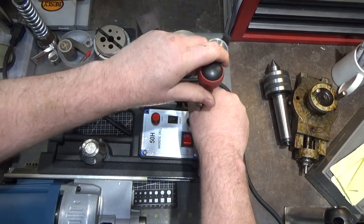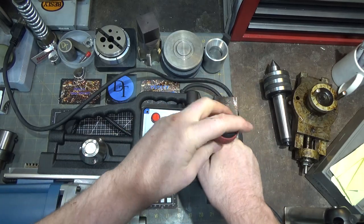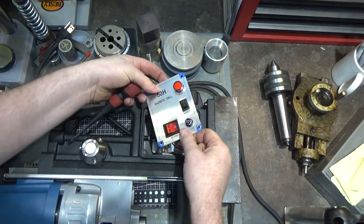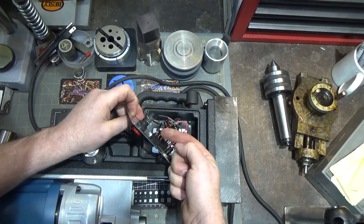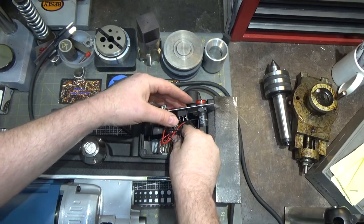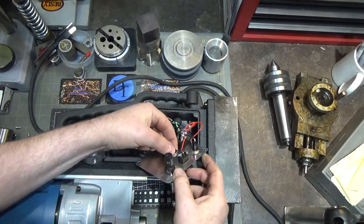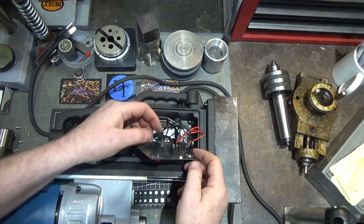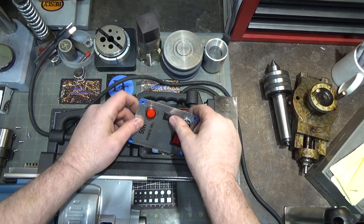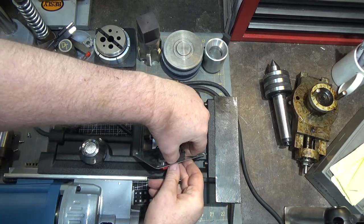This might explain a lot of things about this particular drill motor. I've removed the handles here just for ease of access, and it is unplugged. Oh look at that — there's your full-wave bridge. I could just move this wire to the other side and make that right, so we're going to do that. I can just move these two wires to the other side and that will make this unit go on when the universal 'on' symbol is down. If I wanted, I could also spin this switch around — it's just held in with pressure.